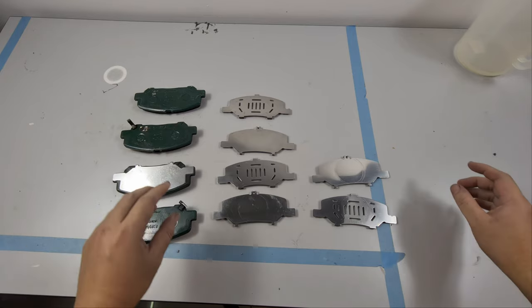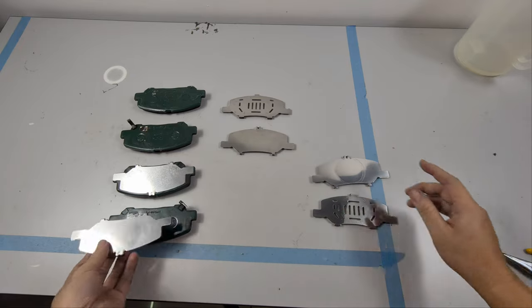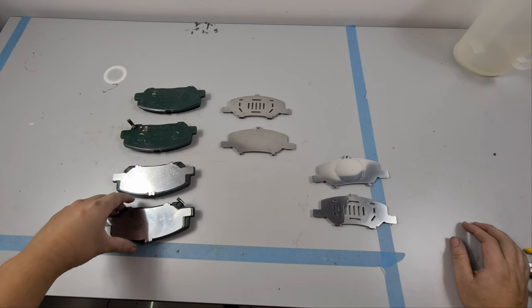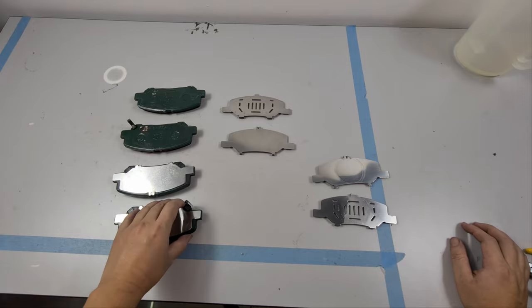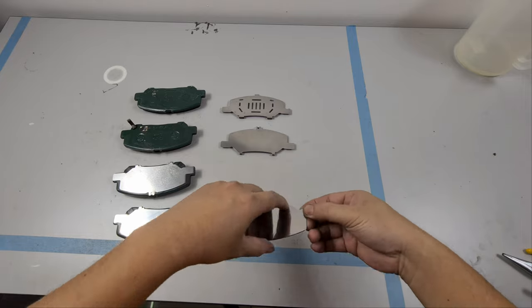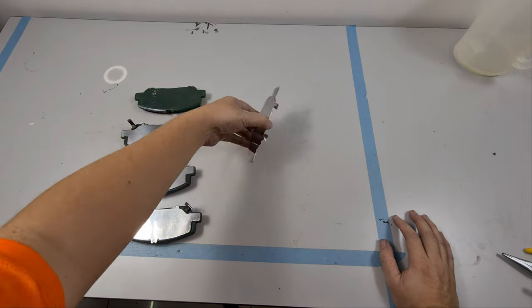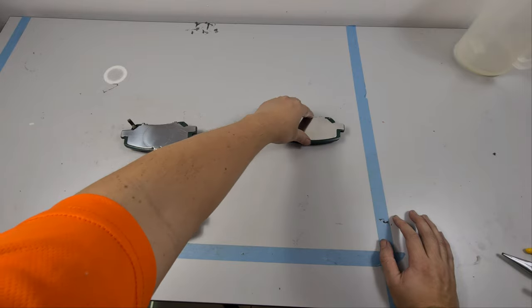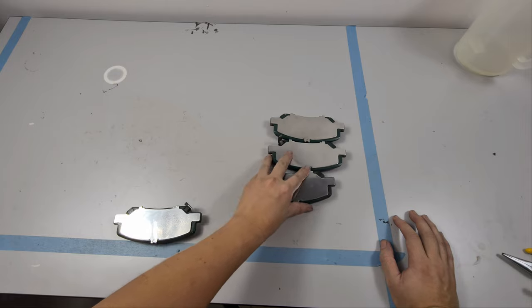Now, let's talk a bit about the type of sandpaper I use. Okay, so I started off with 800 grit, followed by 1000, followed by 2000, and then 3000. And the medium that I use is water, just water. And then I just polish it with, well, paint polish. Okay, because that's the finest one, and also I do not have autosol at my disposal right now. So, well, make use of what we have, right?